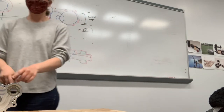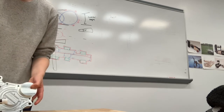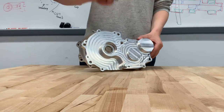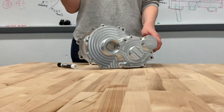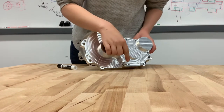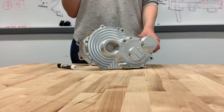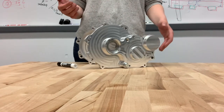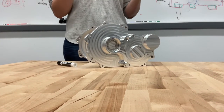One thing that came up: there's a drain plug on this surface. This plug was thought to go on the bottom surface. But when the hardware itself was put into CAD — which I highly recommend — the question was whether you can actually get a 14mm socket on there. The answer was not really, so the right thing was to bump this out so you can easily get a tool on there. Actually keep in mind what your hardware is and put your hardware in the CAD model.